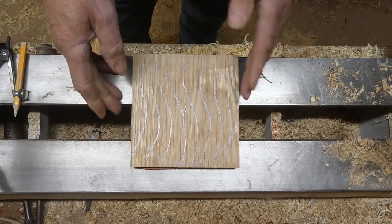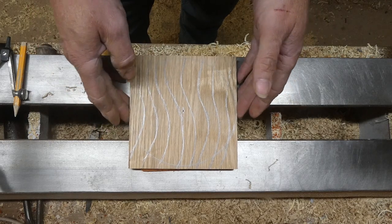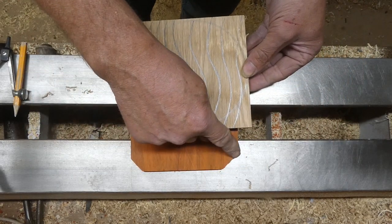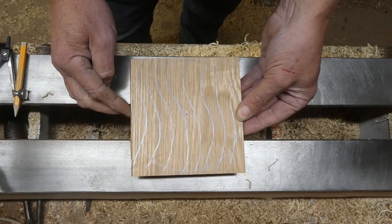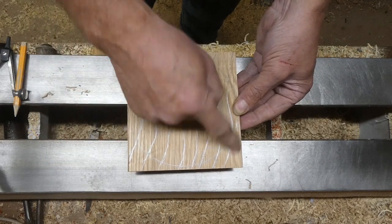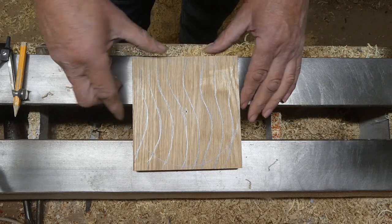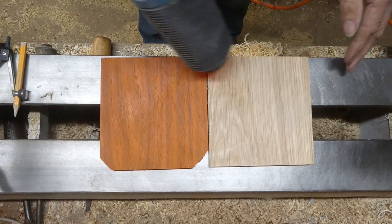Right, what I'm going to do now, I'm just waiting for the hot glue gun to heat up. I'm going to cut through with the bandsaw through both pieces at once, but I don't want them falling apart as I'm cutting, so I'm going to hot glue a strip across there and across here, so it will hold it together while I'm doing the bandsaw cuts. Obviously each piece that I cut off will pop off, but the rest will hold together. And hopefully, if the bandsaw is set nice and vertically, well, we'll see what will happen later on. I'll just wait for the hot glue to warm up. It's quite cool out here today,